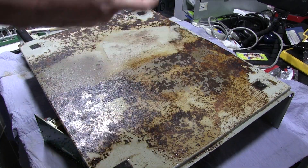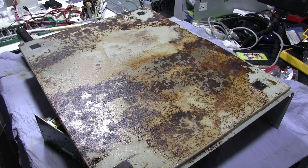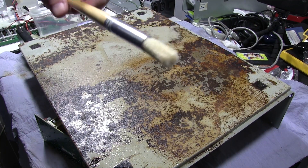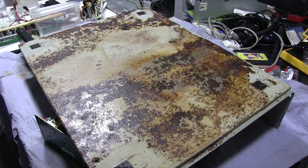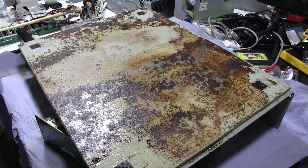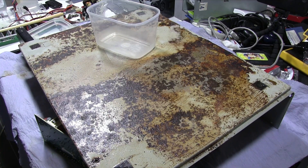Now we have to shake this up — I'll put it off camera because it's never going to look right. Then we need to put it into a plastic container — plastic because obviously it has a reaction with metal — and then apply it with a paintbrush. This paintbrush is wrong entirely; it's got a metal ferrule, which as we just said reacts with this stuff, and also it's very small. But that's what I've got, so it's what I'm using. It should be fine. Now this has an interesting feature: you know if it's working on the rust because it turns a different color as you put it on, so you know almost immediately. If not, you leave it on and reapply later. It may take more than one or two coats, and we need to try to get as much of it in one go as possible — just the one side obviously. You can't reuse any you pour out; you can't put it back because it's been exposed to the environment. So we'll put in as much as we think we need to cover it, but try not to do too much.